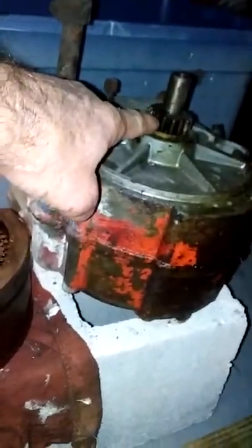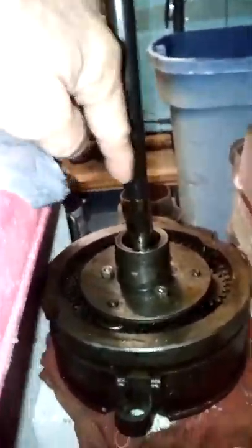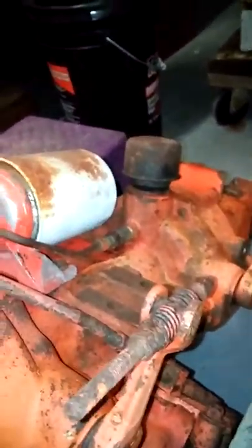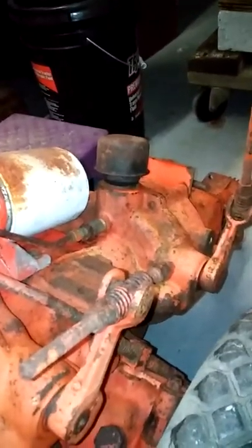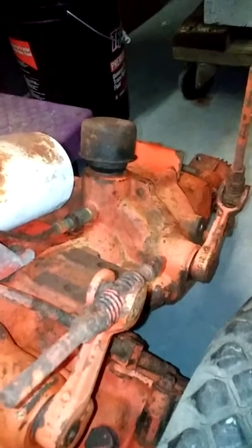This planetary gear comes in through the bottom here, and it drives this whole shaft right here. This shaft drives your wheels and it drives your PTO. I have a high and low on the wheels, and a high and low on the PTO and drive. So I can be in low with the PTO and walking, or I can be in low with the PTO and then high on the wheels — and vice versa.